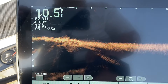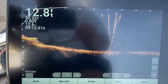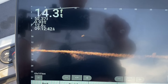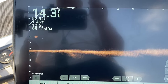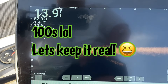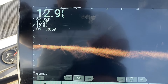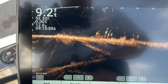See them rocks right there pretty good? Those are my settings — that's what I run. I have a pretty clear image and that's the old two-wire transducer. Try it out, see what you think. If you have a lag running that new 34 transducer, call Garmin and walk through the steps. They may send you a new unit but you've got something wrong. I've set up thousands of units. When you run that noise rejection on high you shouldn't have any issues. That's eight foot there and you can see those spiders I put out pretty good.